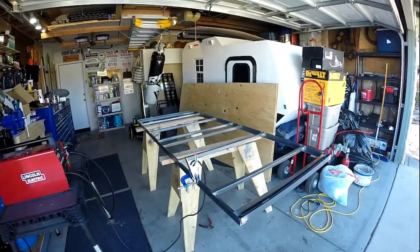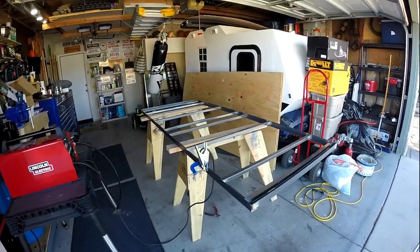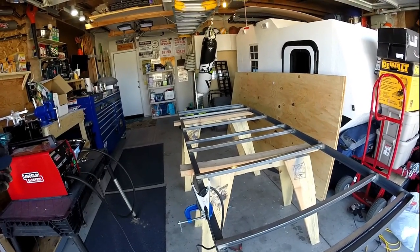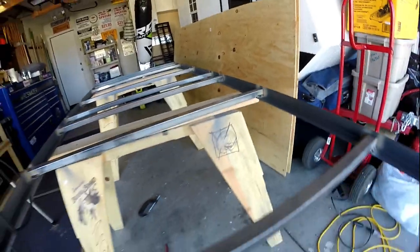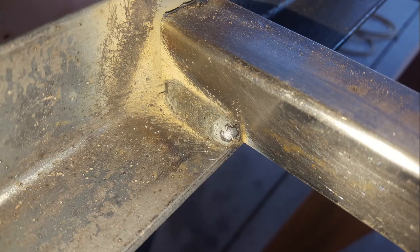Okay, so it's been about another hour, and I pretty much got this one all the way welded up, and I just figured out some more in terms of welding. I've slowed down the wire feed a lot. Started with a shorter piece of wire on the tip, cutting it down, just trying to get some better results. My welds started out looking like kind of popping all over the place, and now they're starting to end up with a little more consistency and better penetration.